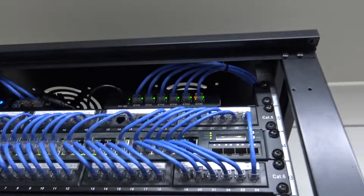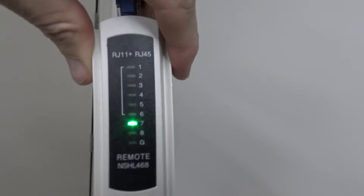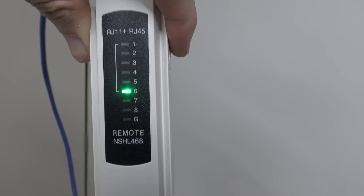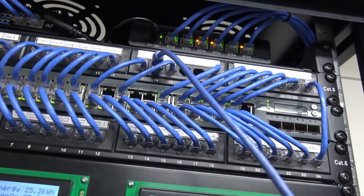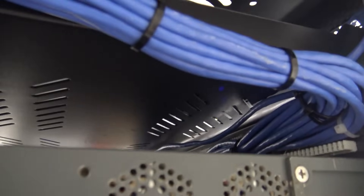What I'm going to do is take that cable out and put one that I know is good, and plug that into the thing. What's this doing? Still missing — one, two, three, four — no five. Okay, so my little patch cable is probably fine, but it means somewhere behind that patch panel or that outlet in there is problematic. I'm going to try that end first because it's a pain to do all this to get to there. I'm hoping it's the wall end — that's where I'm going to start.